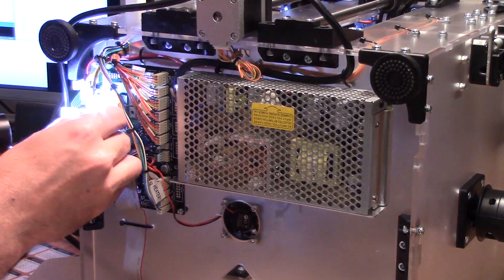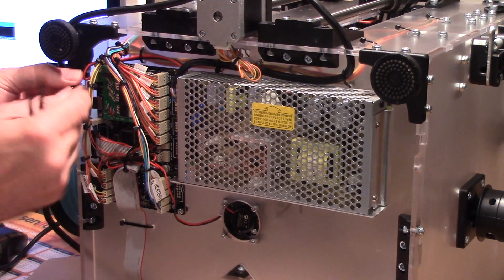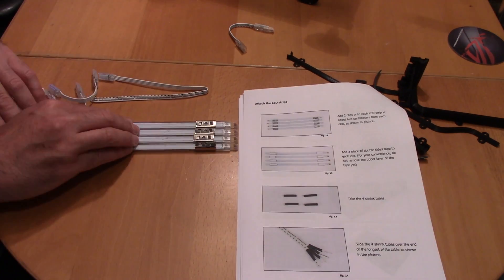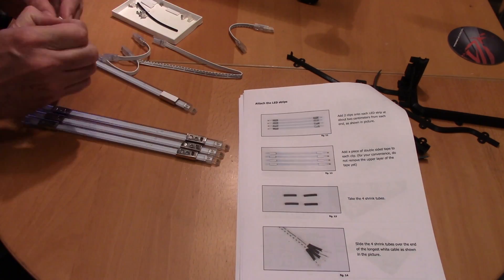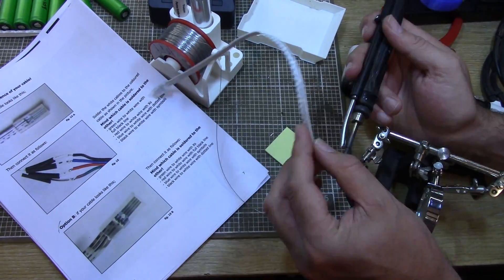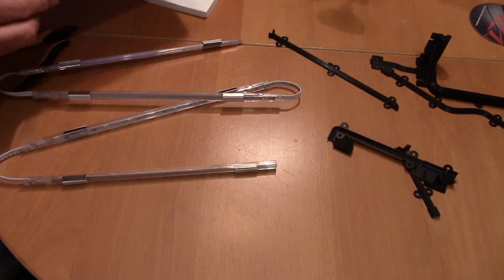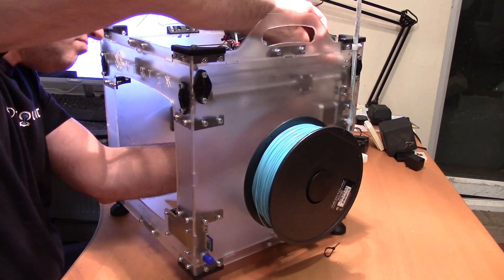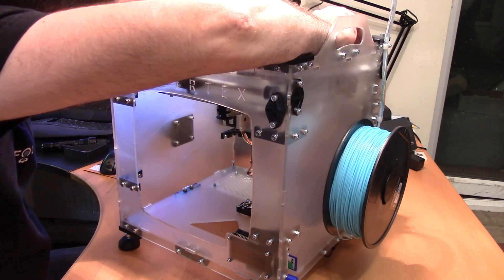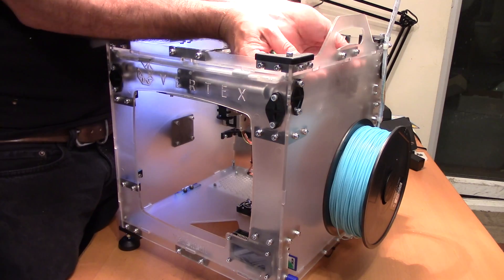We're screwing the power leads back in, and with that we should be nearly ready — oh no, we've still got to actually install the LED strips; that was just the driver board. Put the little metal clips on, put the double-sided sticky pads on, and then drop that into the printer — after a bit more soldering to connect the white lead with the plug onto the colour-coded leads going to the main board. Thread that up through the frame and stick those strips into place, held on with double-sided sticky pads. I didn't think the pads were a great idea but they haven't failed in the week or so they've been on.